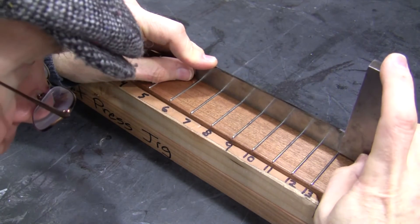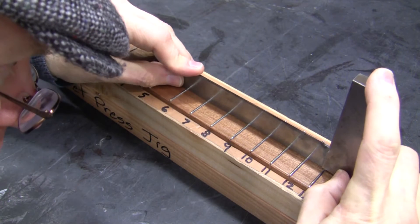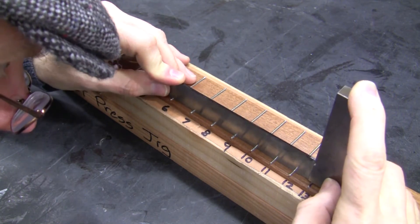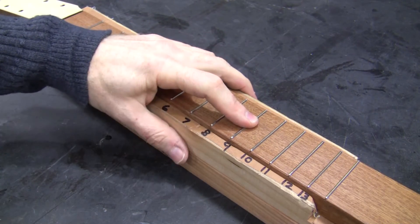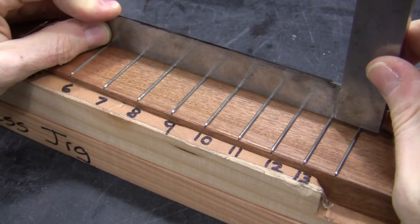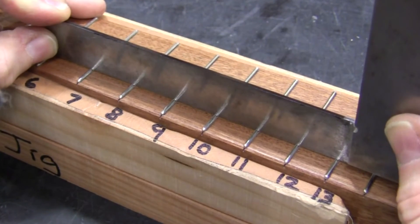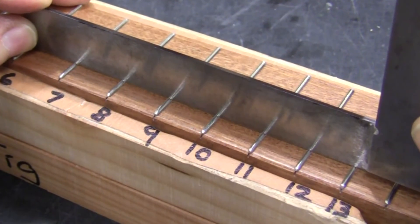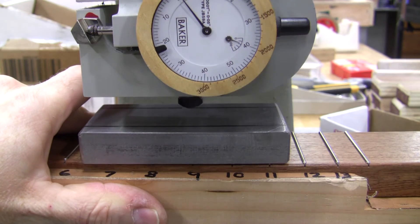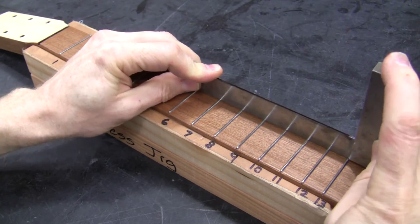Now check how level they are: grab a straight edge and look very carefully and feel very closely. I'm rocking the straight edge and noticing that fret number 9 seems to be the high one — it's high on the right side, high in the middle, and high on the left side. So fret 9 needs more pressure. Put it back and go to 2,500 pounds right over fret 9 — that may do it. I check and find no rocking on the right side, but it's still a little high on the left. To concentrate the force on the left, move that little bar out of the way, push the assembly in further, and the load will be biased to the left side. Now I check again and it's good.